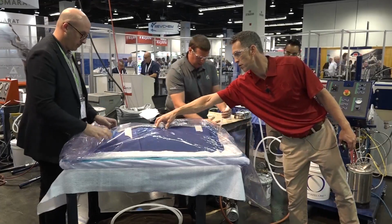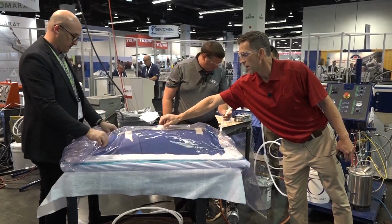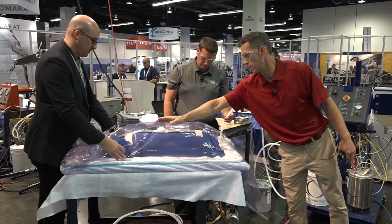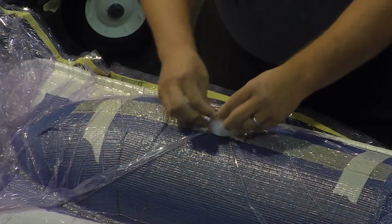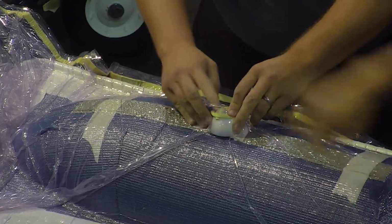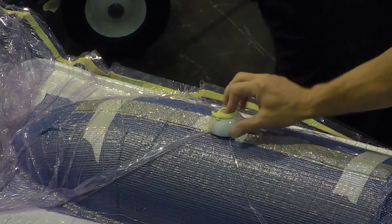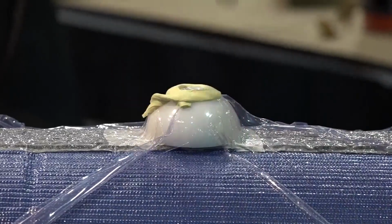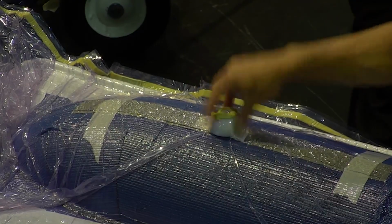It's really critical for the infusion port to have really good vacuum integrity, of course, because this is the area where we could draw bubbles and draw air into our infusion. So now Mike is again putting the sealant tape around the top for his trick. We need to be absolutely sure when we penetrate this bag, what happens is the bag will relax and create wrinkles. Absolutely critical to not have any wrinkles in the resin entry, the resin supply port for our infusion.